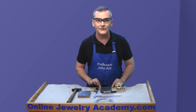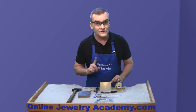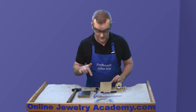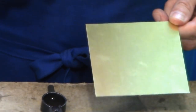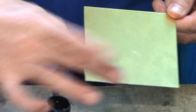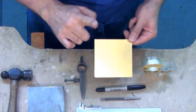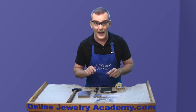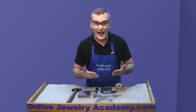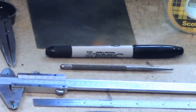Let's talk about the square first. I cut a perfect 4x4 square. The reason why I cut the square to these dimensions is because, number one, this is the size of tool that I want, and number two, I want to take advantage of these corners which have right angles and are equidistant apart so that I can create 90-degree angles on the top surface. I'm going to show you how to make the tool accurately, but for the sake of the video, I'm going to backtrack a little bit just so that you can see my lines better by covering them with some permanent marker.